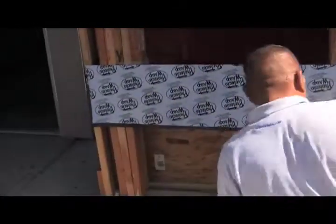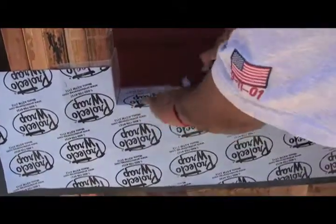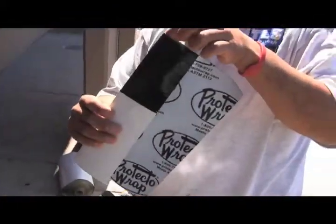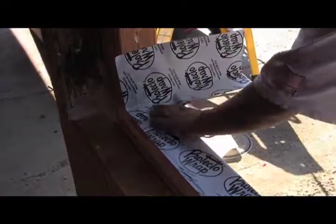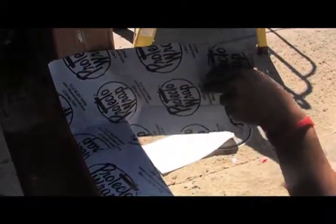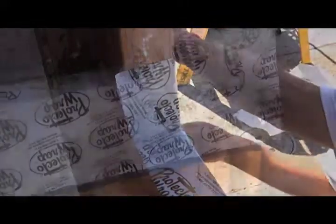You'll notice that Epi is j-rollering his material onto the substrate and applying staples across the top edge. Next, he is going to use a razor knife and apply two vertical slices into his Protecto Wrap so that it will layer nicely onto the framing sill, and then again he j-rollers his material onto the substrate. Now it's time for end dams. We simply cut two rectangle pieces of the Protecto Wrap, layer them into place, put a very simple cut into the material, and fold the end dams into place. A nicely applied end dam will look just like this, and notice that at that lower corner there are no seams in the material.